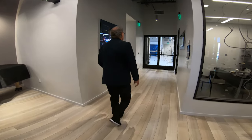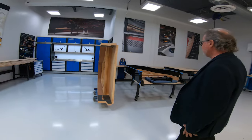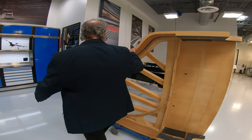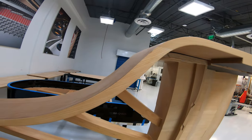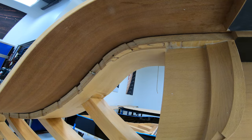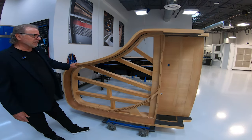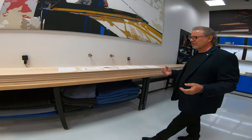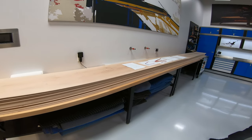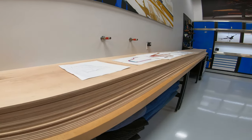Let's take a look at our build studio where a grand piano is manufactured. This is our woodworking area, where we've staged the various steps of building a grand piano. We only build grand pianos here. This is called a rim — the mainframe of a grand piano. There are actually two rims: an outer rim and an inner rim. They're made by bending, using high-end eastern Canadian rock-hard maple strips that are four millimeters thick and 18 feet long, which wrap around to create the rim and cabinet.